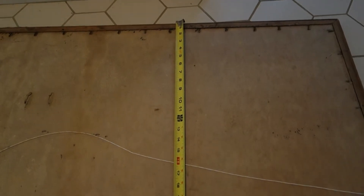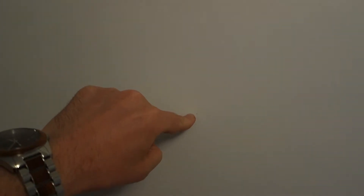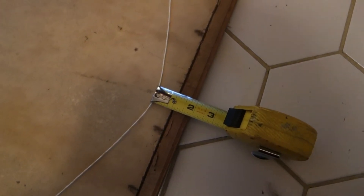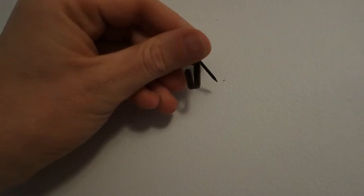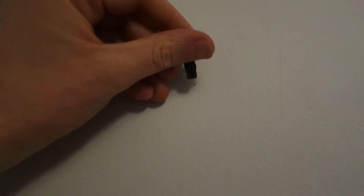The next thing I'm going to do is measure the picture, which comes out to 26 inches. 26 divided by 2 is 13, so I've gone from our original 60 inches up another 13 inches — this is going to be the top of the map. But keep in mind that we have to compensate for the cord, so I'm going to go to that top level and lower it by an inch and three quarters. This is the top of the picture and I've already made the mark where we're gonna put the nail. Keep in mind when you're nailing in the hook you want the bottom of the hook to match up with your mark.